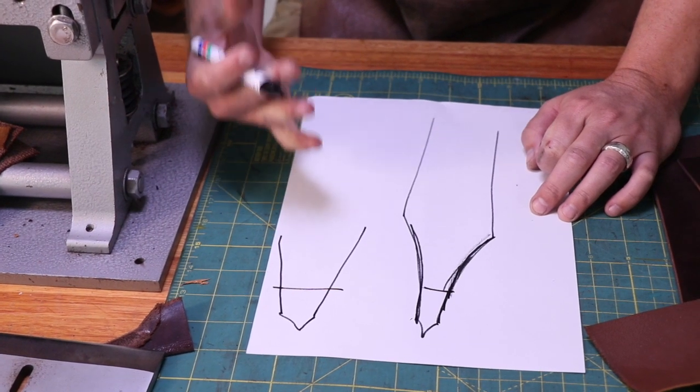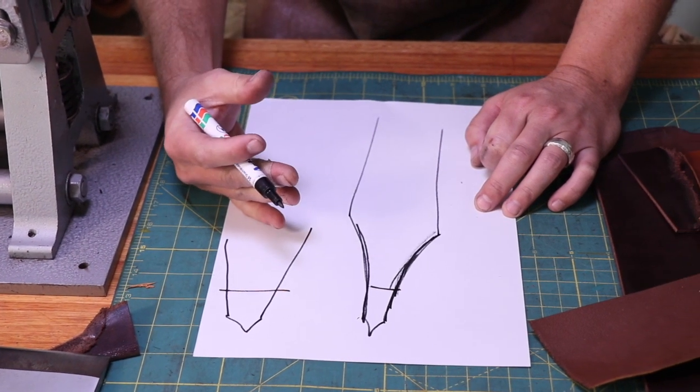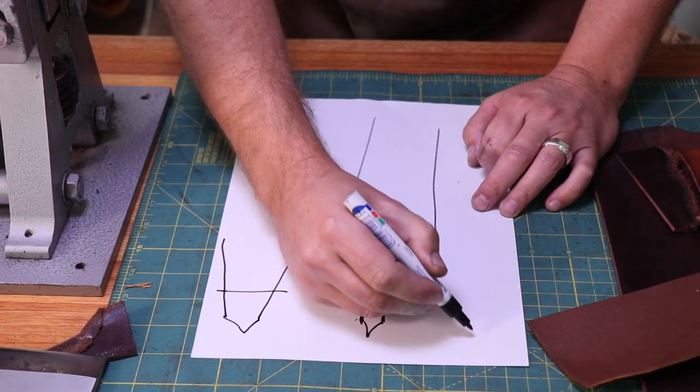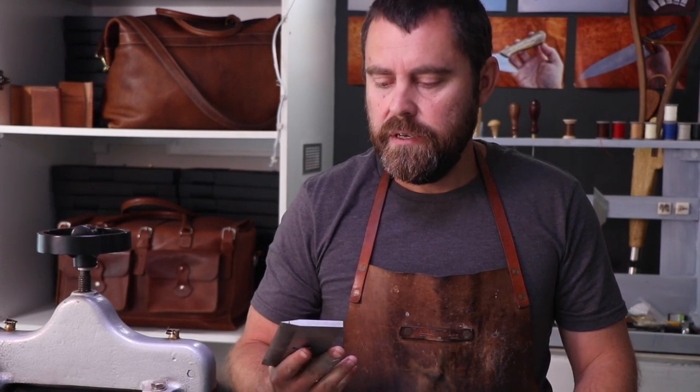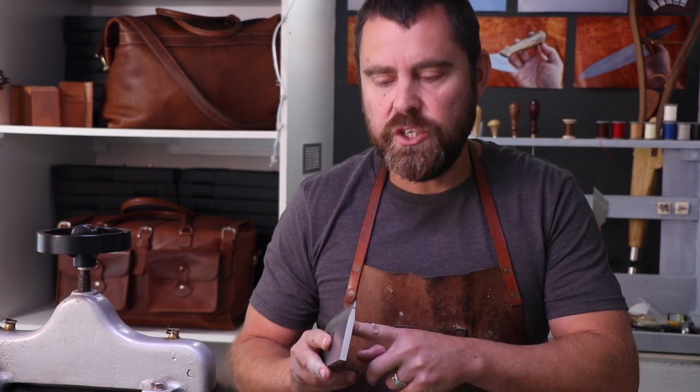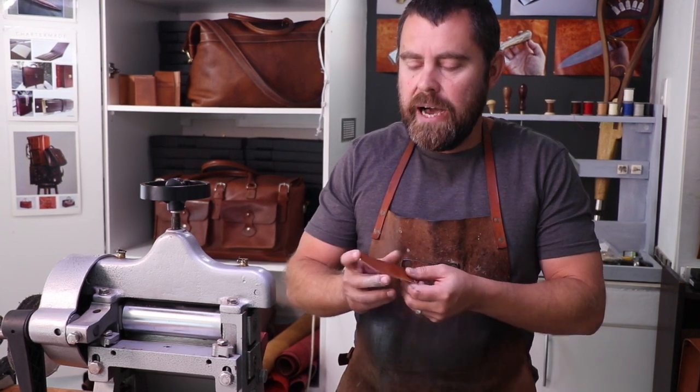The other thing I did with this hollow grind is I did it with an 18-inch wheel. So if you are wanting to get a custom blade or have your current blade customized, I did mine on an 18-inch wheel — that's a big wheel. I think the smallest wheel that would probably work on something like this is around about a 14-inch wheel; I wouldn't go any smaller.